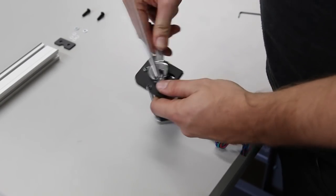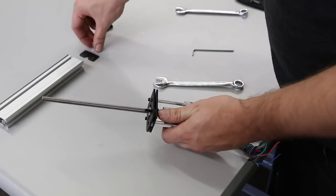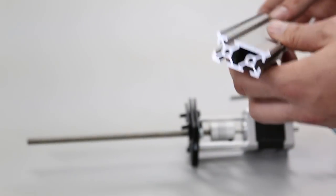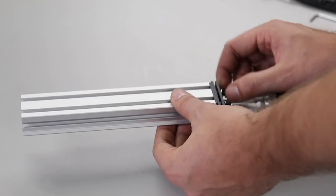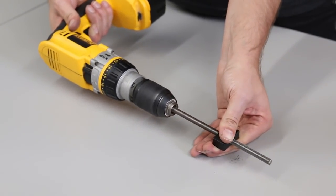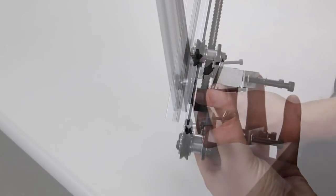You want these two nuts to be tight against the bearing. Now put in the last two spacers and line them up with your hex wrench. Keep the whole assembly on the table for this part — it's much easier to line up the holes with the maker slide, which are the holes you tapped previously. It will be a lot easier to assemble the two sub-assemblies if you use a power drill to push the Delrin nut up the threaded rod once or twice. When putting these two sub-assemblies together, make sure the eccentric nuts are set at the widest possible spacing.